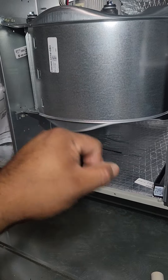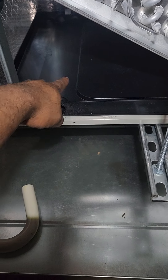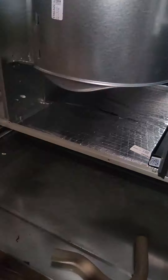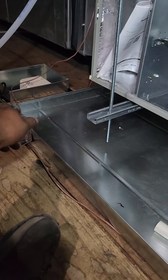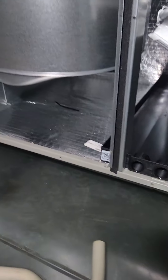When the unit is closed up, the fan is gonna pull from this section and literally pull the water back from draining, keeping all the water in here, or it'll overflow until the fan stops running, then it'll start draining. The other reason is you don't want to pull air and odors back into the unit from a main house drain or sewer line, and then into the ductwork and into the house.